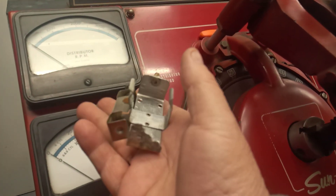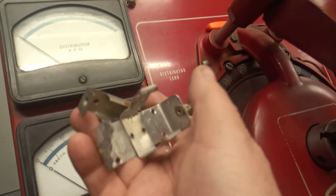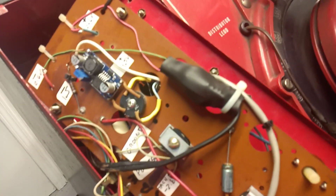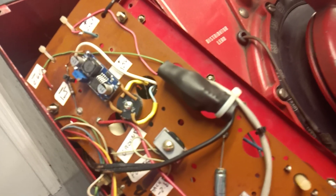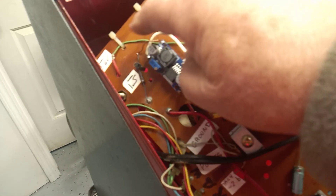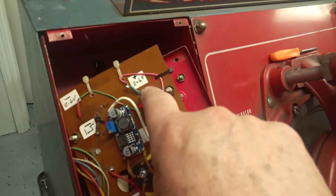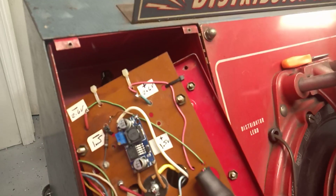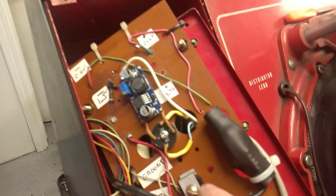The batteries were non-existent and the holders were kind of bad, so I converted this. Some of these machines have the batteries in series, others have them floating. I basically interpret every one of these as floating. This one is floating — it uses two mercury cells in series for 2.6 volts. You get this red and blue wire up there; they put two batteries in series in a tube for the 1.5-volt D cell.